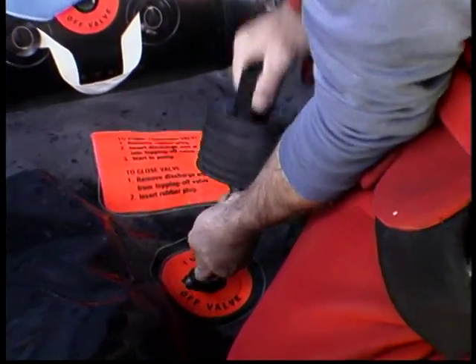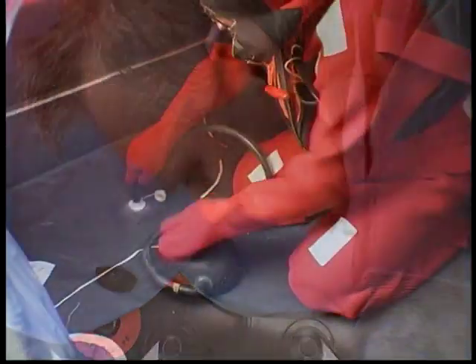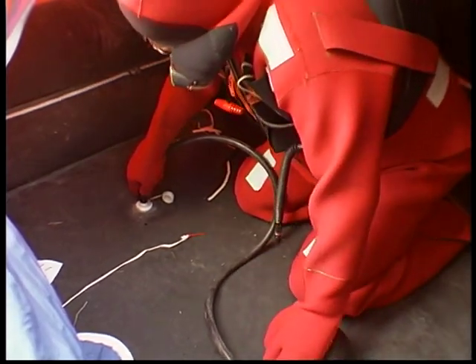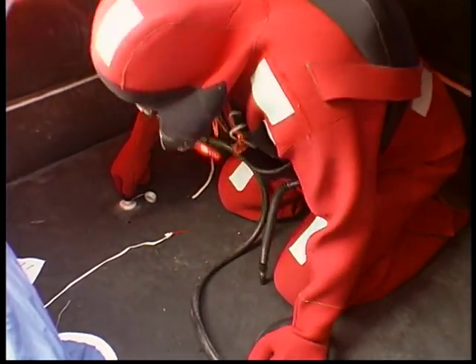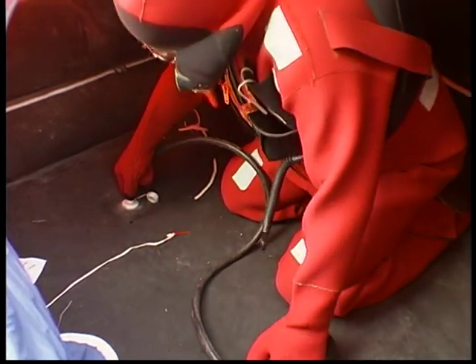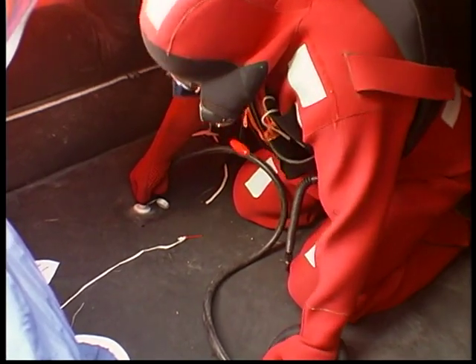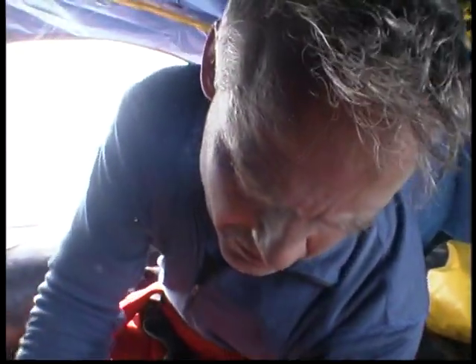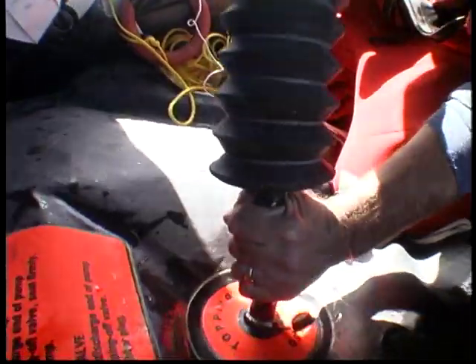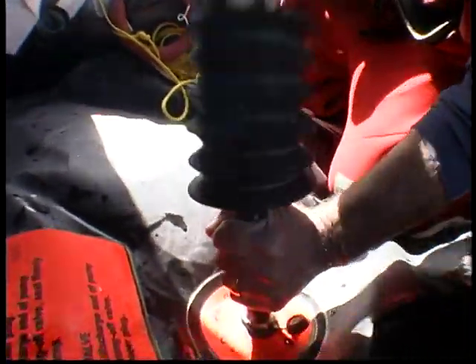The pump is used to keep the life raft fully inflated. The pump and valves in your raft may look and operate differently from those seen here. Inflatable floors do not inflate automatically — find where to inflate the floor and inflate it. Even in tropical waters, you will want the floor inflated for insulation. Some floors do not inflate; they have built-in insulation.